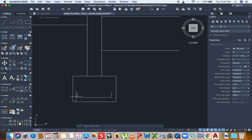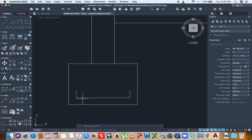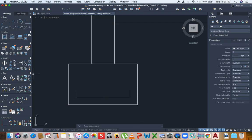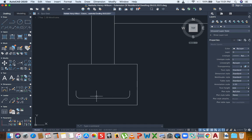So this is the steel bar that is resting on the ground, spanning from one corner across the width. I am going to fillet, or you can say bend, it. I'm going to use the fillet command. I'm going to press R for radius, and then change the radius to about 25. Can 25 work? All right, so this is working.